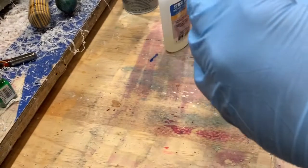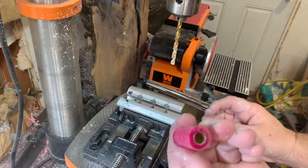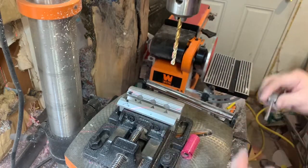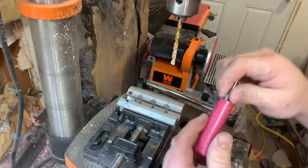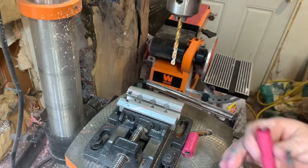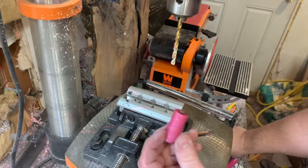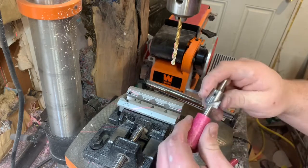Okay, these have dried. I've already popped the little plug out of this one — when I do that I take one of these reamers that you use for pen mandrels. I've gone through so many of these I have a couple laying around. I just take it and do a couple little flaps and it pops the little plug. It's superglue that builds up there. Clean that up a little bit and now the small one I have fits just perfect so that'll clean it up real nice.